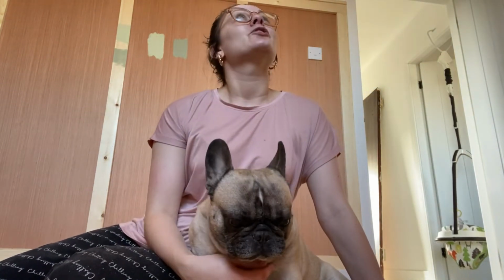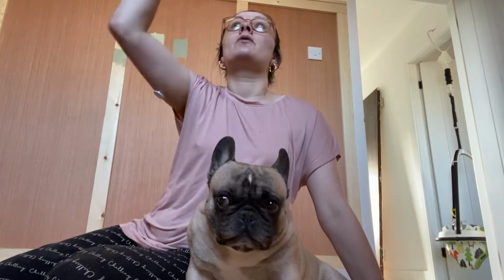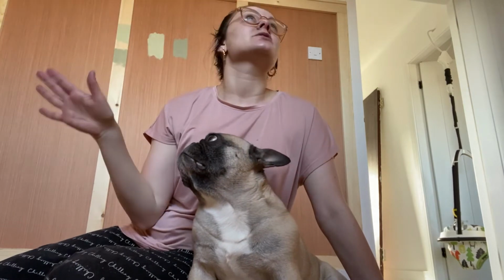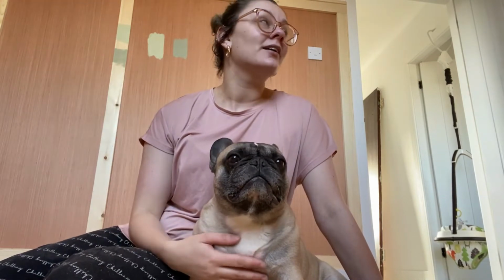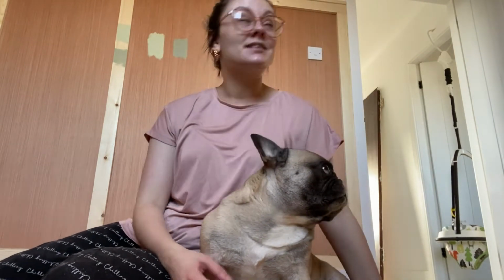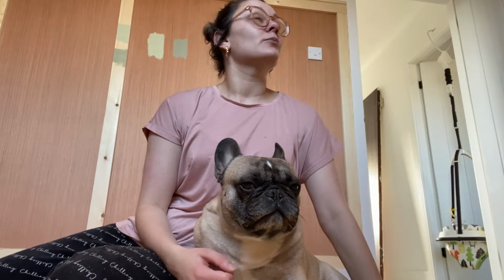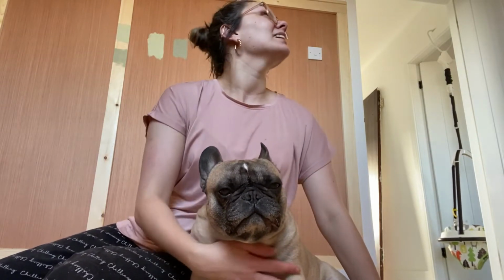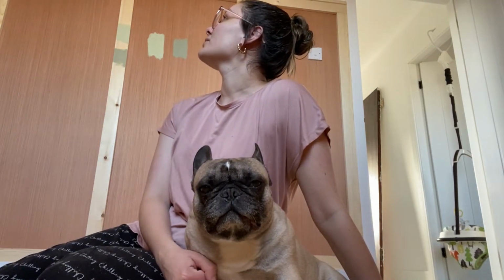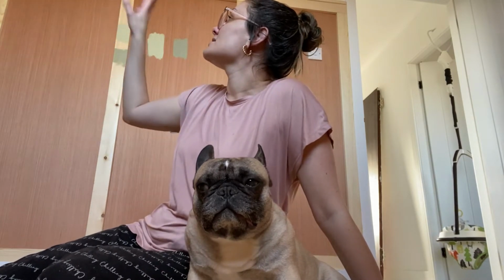Before I do any of that though, I am going to go ahead and do the top part. Like I said, the white bit needs redoing. There was a lot of mould on the white bits up near the coving, so that's all sorted now. I just need to repaint. There's some splits in some of the lining paper which I need to try and fix, so fingers crossed I can do that okay. There's a bit of bubbling on the corner where the lining paper went round the corner, and I've never really been happy with that, so I'm going to try and fix that as well. Fingers crossed that goes fine. And then maybe just repaint the ceiling, and obviously I'll need to repaint the coving and the walls. In that corner there's a tear in the lining paper, so that needs caulking up.